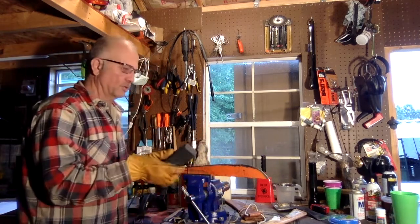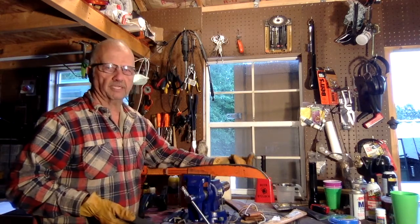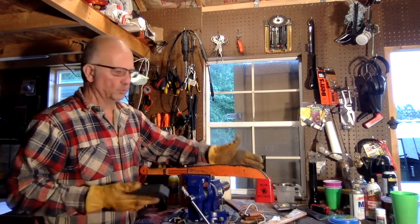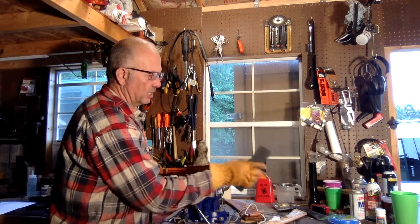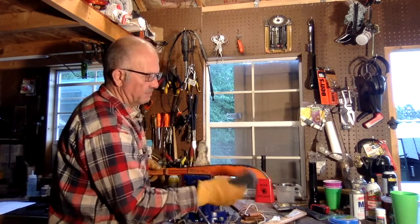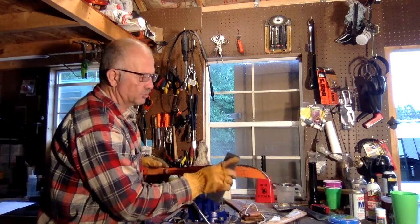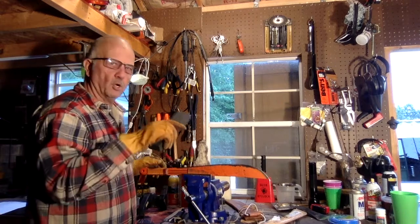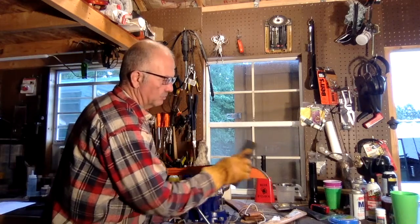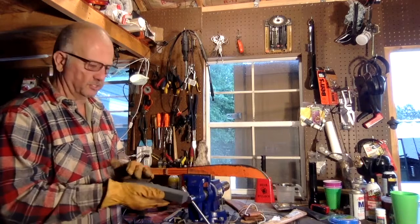The other thing you don't want to do with a thinner blade like this is push the edge so far to the other side that when you start sharpening the other side of your bevel, you're taking more metal off — all you're doing is reducing the life expectancy of your tool. So nice, even, slow, and light, and you'll start to see it coming together. With machetes, you're going to get a lot of nicks where you've been chopping roots and hit a rock or two. Try to get those nicks out, but don't necessarily go in deep to get them out — they'll eventually be sharpened out. Keep adding oil as you do this and wipe your stone off every now and then so it doesn't clog.